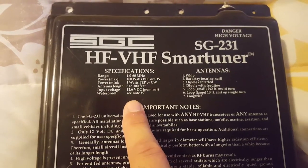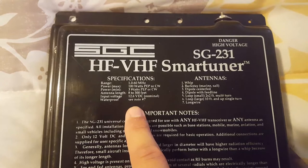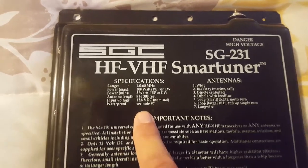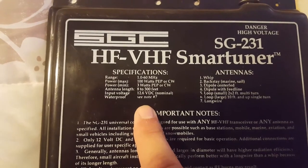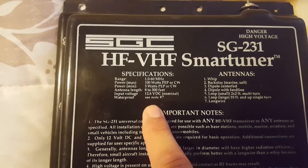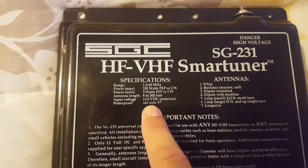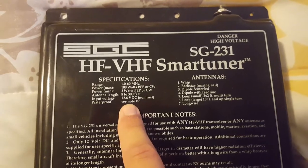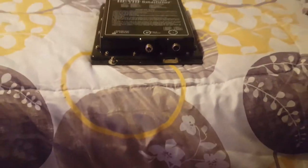This is the SGC 231, so it's got a much higher tuning rating than all the other SGCs combined, and a higher average rating — it can handle like 80 watts continuously, versus the other ones which I think are only like 60 watts. This will do from 1 MHz through 60 MHz, and I have tested it all the way down to 1 MHz and it will tune. 100 watts peak, 3 watts minimum for tuning — though I think I've tuned it on 2 watts, but it's kind of touch and go. You've got a wide variety of antennas you can use, from 8 to 300 feet, at 12 volts. Make sure you have steady 12-volt power — if it wavers, this little box does not seem happy about that, and my experience is it loses its tuning.